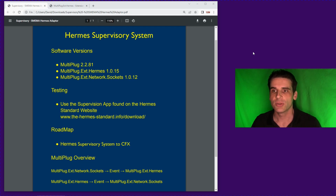In this tutorial I'm going to show you how to set up the supervisory channel, or the supervisory system. That's the connection with a server that's going to serve full Hermes data to the adapter based upon some known values, maybe a barcode, maybe a work order. In this I'm going to use multiplug 2281, Hermes extension 1015 and network sockets extension 1012.